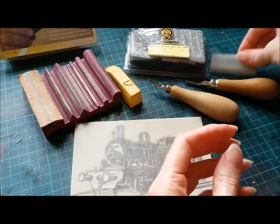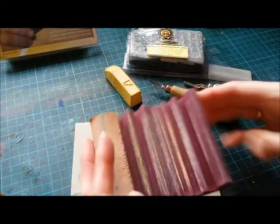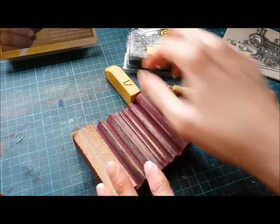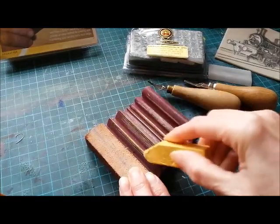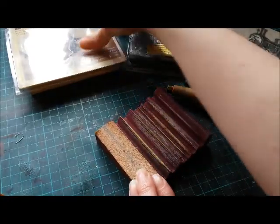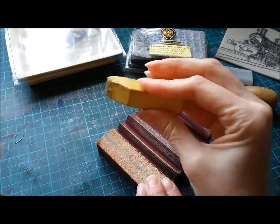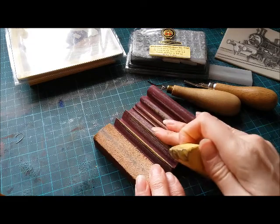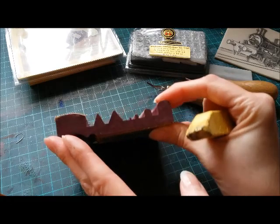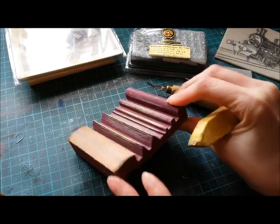Okay. So once I've sharpened up with the whetstone, then I'll go on to the SlipStrop. Now, as I said before, the SlipStrop you can actually use several times during one carving. It's not as brutal a sharpen, if that's the right word. All the instructions come with the SlipStrop. But what you do is you get this compound, which is like a gold compound, and this is made out of balsa wood, I think. It's certainly similar anyway. And you can see all the different profiles on there, so you can get all your different shapes of carving tool.